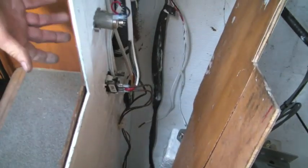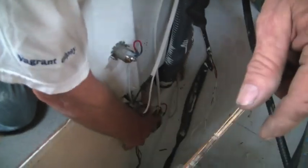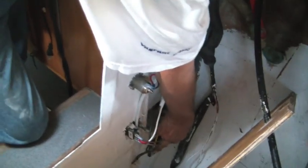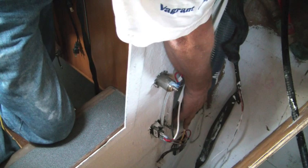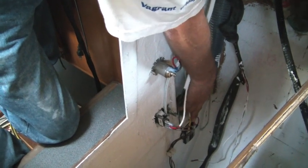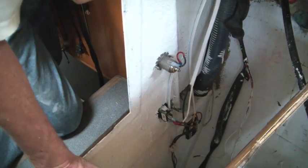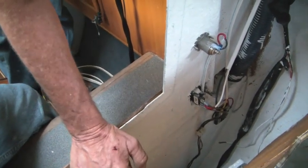This is our 12-volt cigarette lighter type outlet, which feeds down to a little distribution block. Our hot lead comes in at the top, and then we can tap off for any circuits — our fan, our lights — all can just tap right off here. That's all going to run off a circuit breaker on the main breaker panel. I think those are 15-amp breakers, so you've got 12-gauge wires coming and feeding it, and 16-gauge on the short runs up to our lights and fans. Nice clean setup. You've got your manual, you've got your automatic, and the bilge pump is automatic, so the safety's there for flooding of the system.